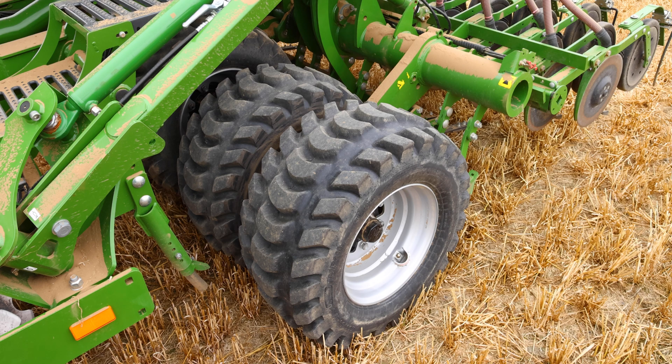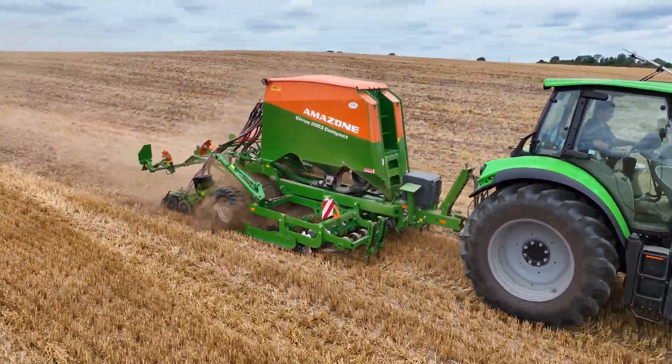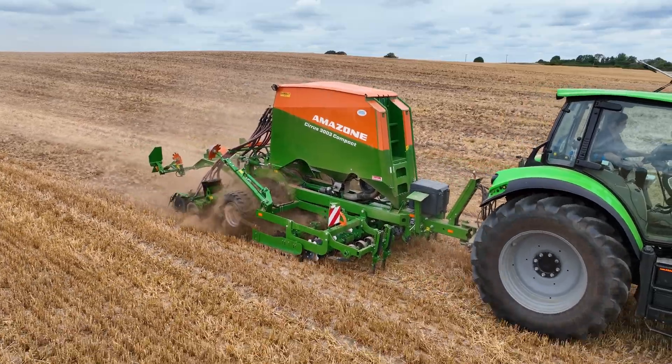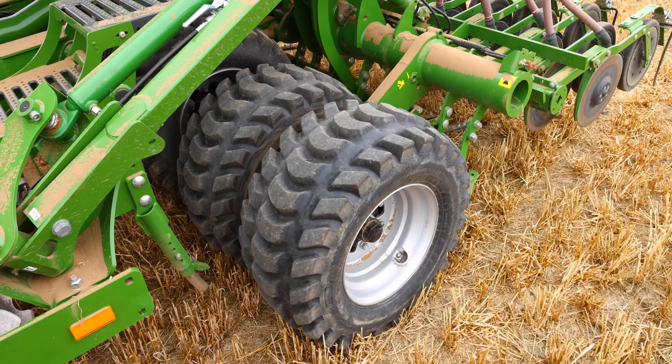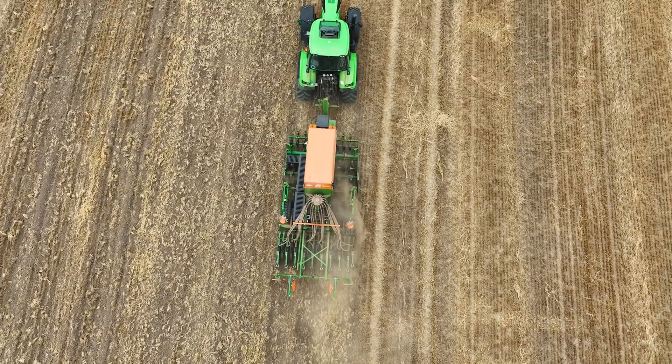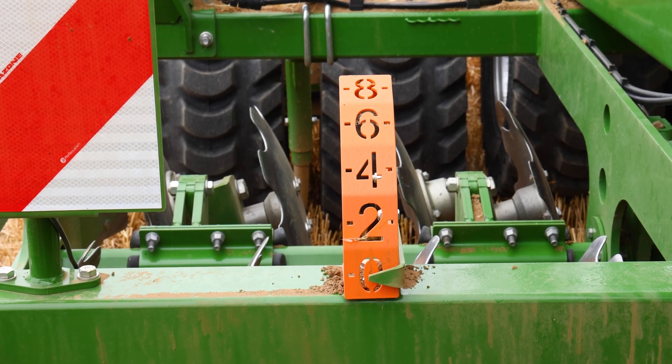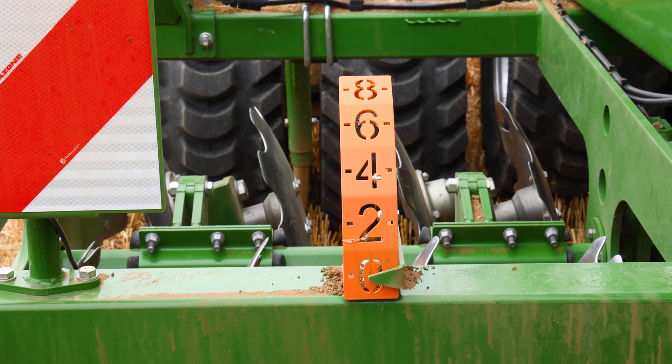The matrix wheels have grips that run in front of each disc coulter for consolidation. As you can see the shape of the tyre — the centre lugs are wider, covering two sets of discs, and the outside lugs are covering one disc each. Behind each wheel we have a full-length scraper and just behind that we have a furrow ridge eradicator.